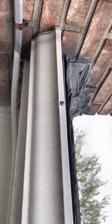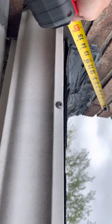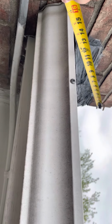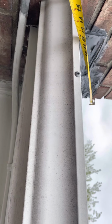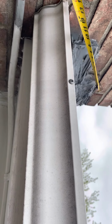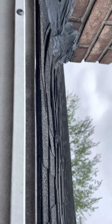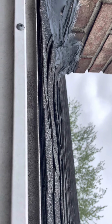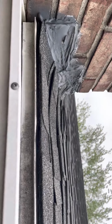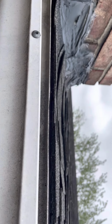And then the same on the upper chimney. What we're going to do is we're going to grind into the brick at an angle here, put a counter flashing in, but we're going to run a full piece on the back side also. That's going to come up 3 courses of brick, grind into the brick, and we're going to flash it up underneath, as high as we can with the shingle, into a full 24 inch wide apron flashing going across the back top of there.